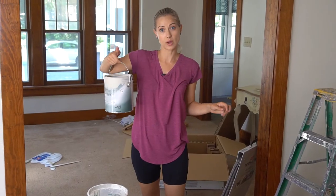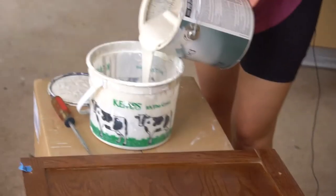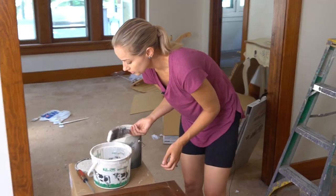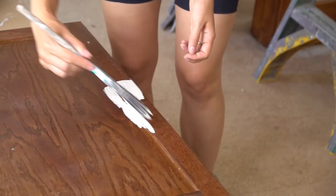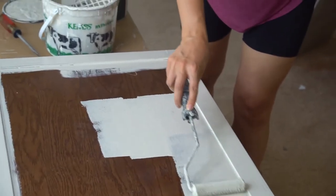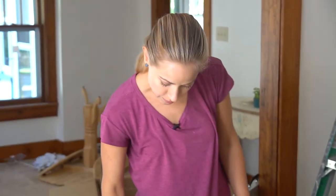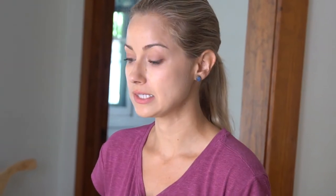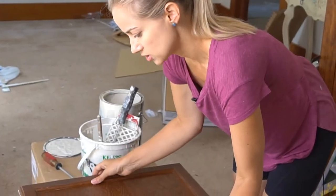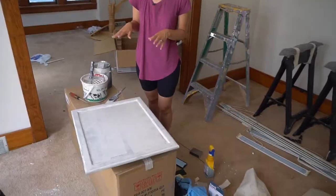Time to take that bonding primer. Most people would use a pan and liner, but I recommend an ice cream bucket, because it gives you an excuse to eat an entire bucket of ice cream. You're going to use an angled brush for the detailed areas — think corners and creases. For the big area, you can use a roller brush. Since I have the ice cream bucket, I'm going to use a grid. The primer doesn't have to be perfect — it's just here so the paint sticks better to the wood. Once this side is dry, you're going to flip it over and do the same thing on the other side. After you're done priming, this is where I suggest you stop between days one and two.